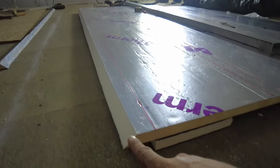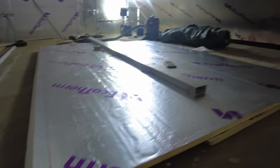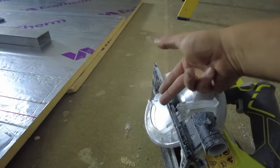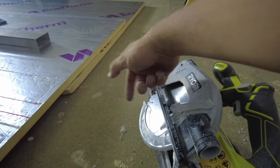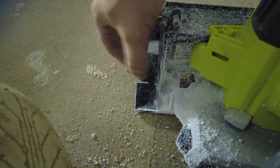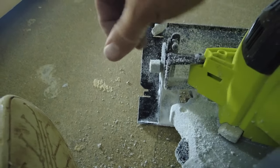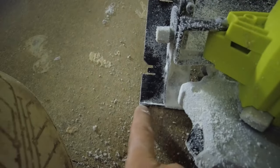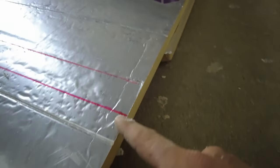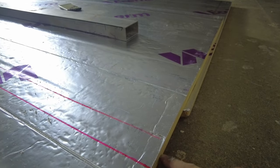Just a quick tip if you're doing this. See, that's nice. It doesn't throw up too much dust. I don't know whether turning the blade backwards actually makes a difference or not. Make sure you do it on the deepest that you possibly can. This cut's about 28 mil deep. And whilst you do have markers, if you're cutting on a 45, it's really hard to follow a line because the dust kicks out. So if you draw a line from this edge here, like I have here, when you follow it down, it's easier. The cut will end up being over here somewhere. See you tomorrow.